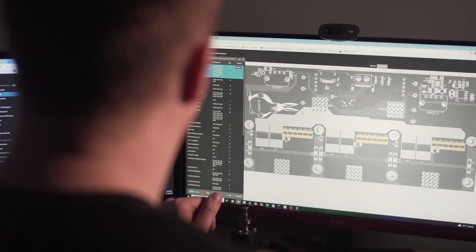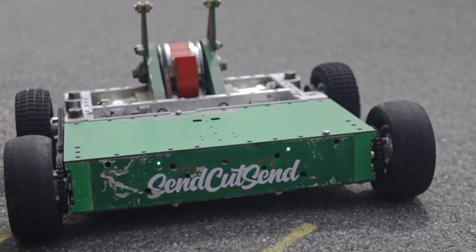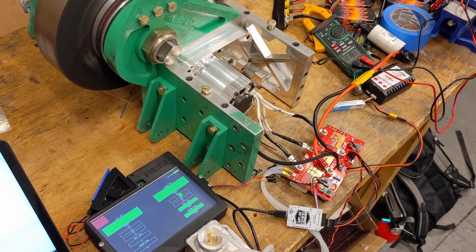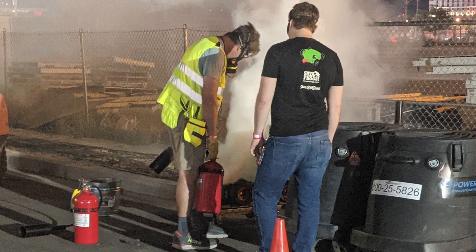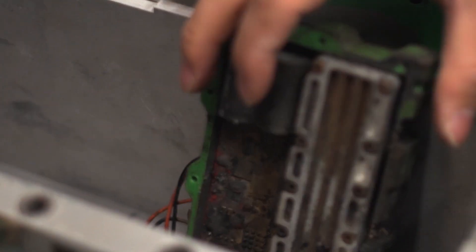It's very difficult, especially on the weapon system, to separate the battery pack. It's really tough to test a heavyweight weapon. For a 250-pound robot, there's really only one place to test it safely, and that's in the test box or in the battle box at filming. We ended up catching on fire. Pretty much almost all of the fires that we have are board-related — they may start with the board and end up with the batteries, but they almost always start with the boards.